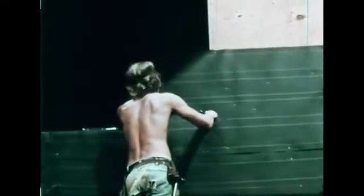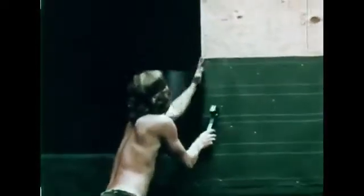On this house, the walls are completely covered with building felt to provide extra protection. Usually, narrow strips around windows, doors, and corners provide sufficient protection from water penetration. Once the house is protected from rain, plumbing, electricity, and other interior work can begin.